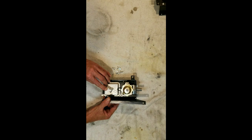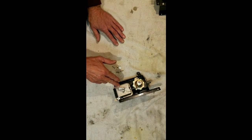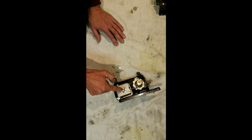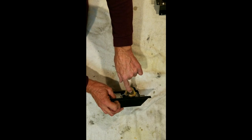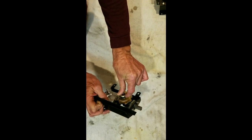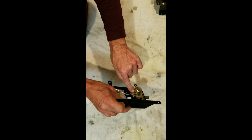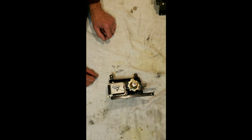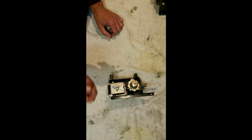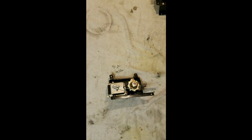I put the arm out here, and to get it there I'm going to hook up the battery charger and we'll test it. Basically to talk you through it - in this position, once you get it there, that's the farthest throw. This is when the valve's shut, we've got the half position or quarter position, and fully open is over here. You want to make sure you've got enough length - this is the farthest throw this way - and you want to make sure it goes all the way up and just barely doesn't touch. There is flex in this and it's a strong little motor the way it's geared, so it pulls on it pretty good.